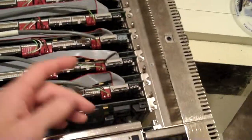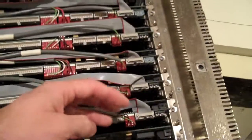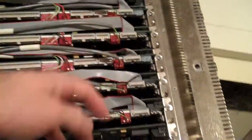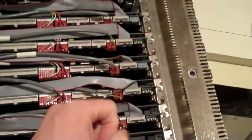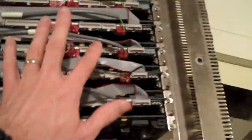This may have been an integrated cable — I'm not positive. However, the supervisor card itself had a pair of RJ11 phone jacks, and you would daisy-chain the cables between the chassis. The full supervisor board — like I had — which in a proper supervisor chassis with the drive would be the master chassis. Each of the other chassis would have an IES module, which was a remote unit. It would pull in all this information and send it up to the supervisor board, which would control all of the chassis from that one board. The BC Vision software would be able to review all of the chassis in the array from that one system.